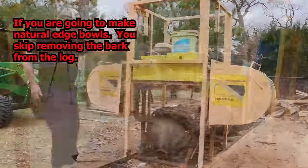Now, keep in mind, I've got to make sure that I've still got wood underneath, since the tree is cutting under on me. But if I took a 10-inch bowl, I could probably get a 10-inch there. Nope, can't do it. Thought I could get a 6-inch, can't do it. So I'm going to capture as much of this as I can because that's the prettiest part of the wood. And that is an 11.5-inch bowl blank. Why isn't that a 12-inch bowl blank? Because if you have a mid-sized lathe, you can't put a 12-inch bowl blank on a 12-inch lathe, because if there's any imperfection on the outside of it, it'll hang on the bed of the lathe. So we cut them 11.5 inches, and that assures that they'll go on a mid-sized lathe.